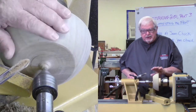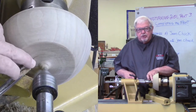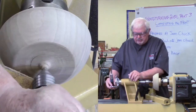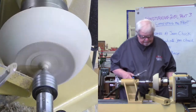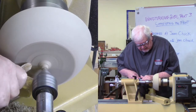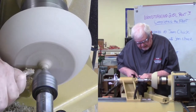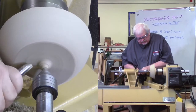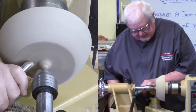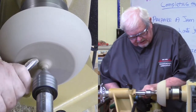This is the same cut we used on the outside of the bowl. I'm putting my tool against the wood, letting it ride against this small shoulder, and allowing it to cut itself. I'm not applying a lot of pressure in this direction - I don't want that to move. I want to make sure this stays where it is. Now I want to make sure all this surface here is smooth, so I'm going to do a sheer cut - that's where I'm using the lower wing of the tool, handle down at as little an angle as I can get it, just pulling back to take off any additional marks.